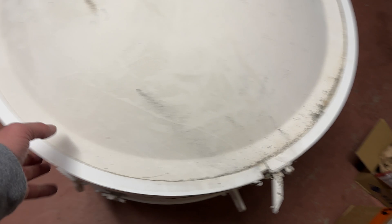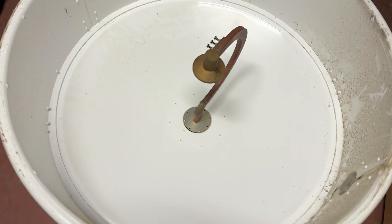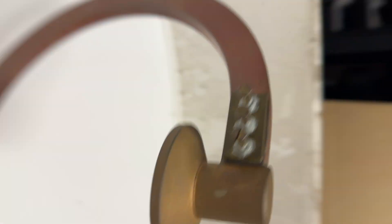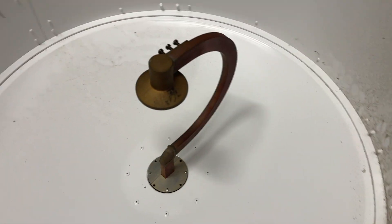We believe this dish is good on the 10 gigahertz amateur band. So if I take the radome — the protective radome — off the top, that's what it looks like inside. That's the feed. We've got an interesting-looking window-type feed in there that bends into a shepherd's crook.